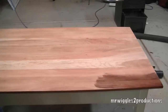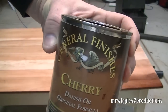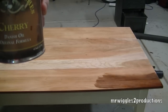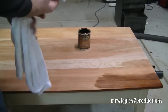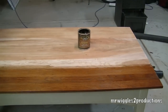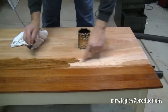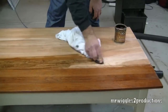The stain I'm putting on is actually an oil — it's a cherry danish oil made by General Finishes that I usually get at Rockler. It matches the color and will blend in that white sapwood in the middle pretty well. I'll wind up putting two or three coats of this on. We're about 45 minutes into this project. You can see the strip of sapwood — this board is going to match pretty well with the other pieces, with the heartwood.